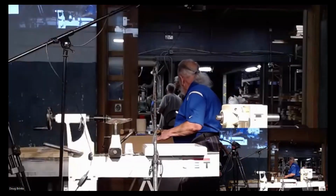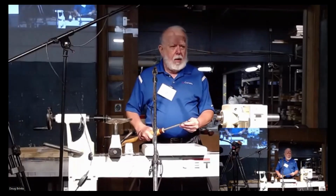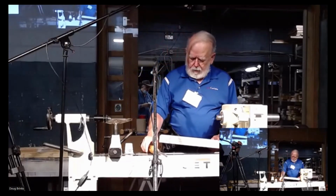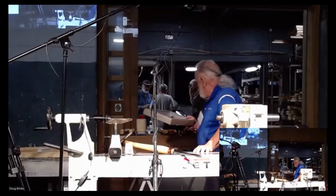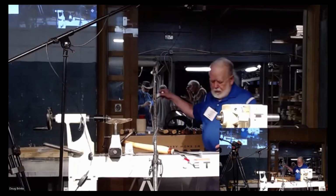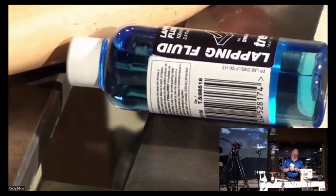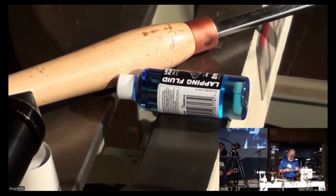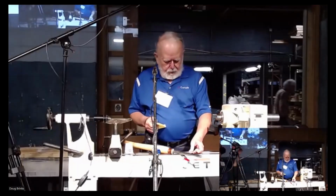Now, another question that comes up frequently is, can I sharpen my carbide? Absolutely, with the right tools, okay? You have to use a diamond card and the lubricant. We sell the Trend lapping solution, okay? And yeah, we sell the cards also. I'm out of the 300, 600, supply chains kind of let me down out of the UK. This happens to be a 300, 600.